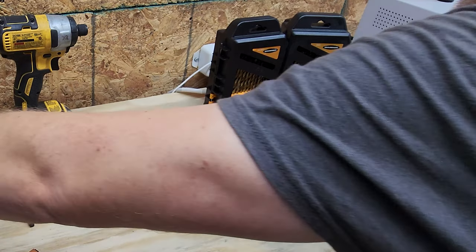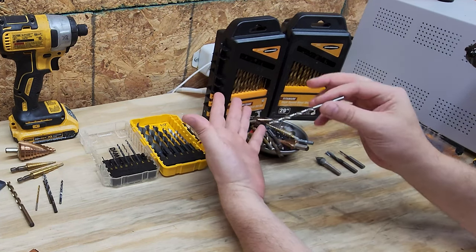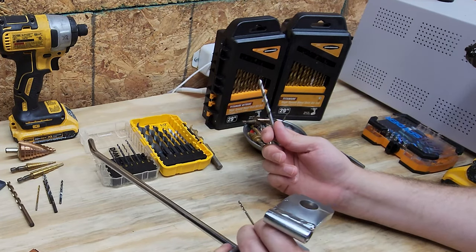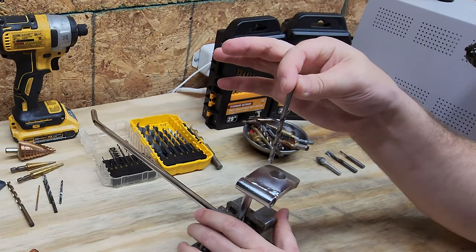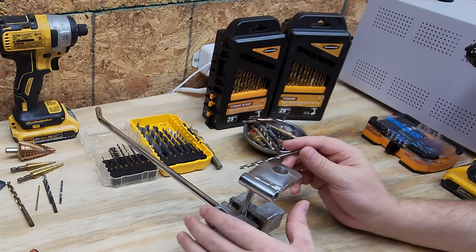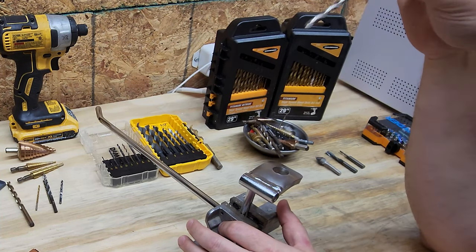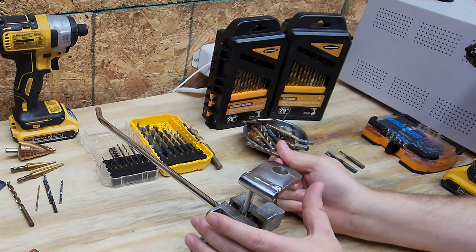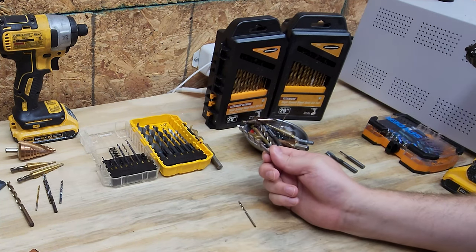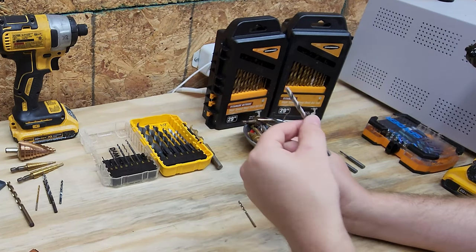Just like with knives, your edge will wear away if you try to tackle a harder metal than your drill bit. For instance, this stainless steel — if I were to drill it with high speed steel or some of the cheaper steels found in some Chinese drill bits, you're going to dull the bit almost instantly. I probably have a load of dull drill bits because I generally work with harder steels. Since I do a lot of metal work on medical equipment, I'm always looking for the next best thing.